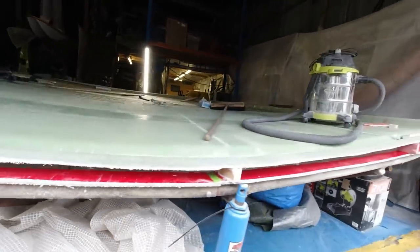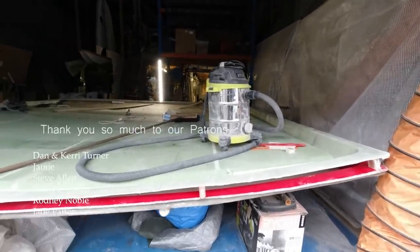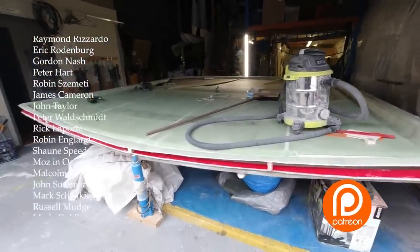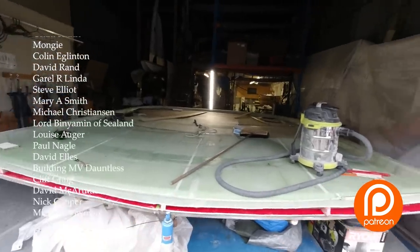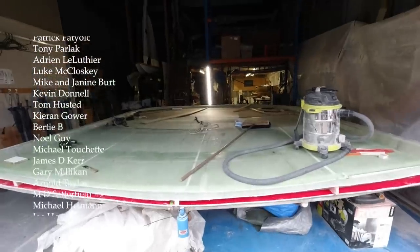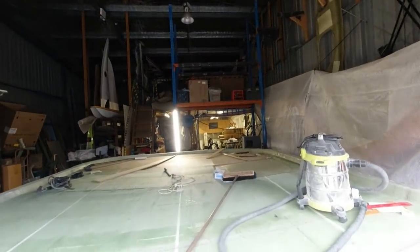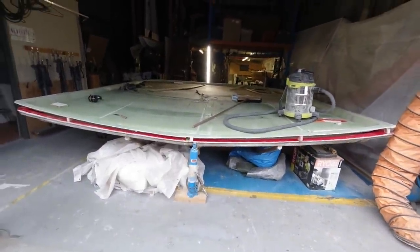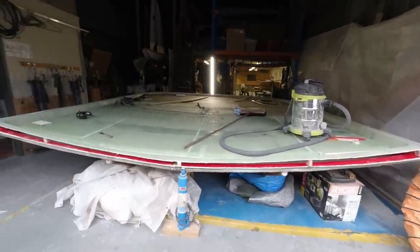I'm just going to leave it hang there for the night. And I think I might put some ratchet straps around it so I can rig it for lifting without having to put mounts in it. I really don't want to be putting any lifting mounts in it if I can avoid it, because they're just going to have to get ground off anyway. I'm better off to put some straps right underneath it on both sides, lift it up, and then I might even be able to turn it within those lifting straps. Maybe suspend it from the purlins in the factory here, because it's not that heavy, and that would be a very nice way to turn this over. I'm not really sure I want to turn it over just yet. Got to think about what else I need to do in it, but at this stage it's pretty light. I'd say it's probably only 150 kilos, but that's pretty amazing, really.